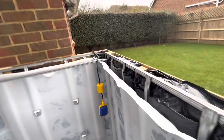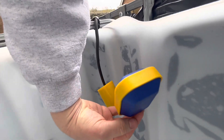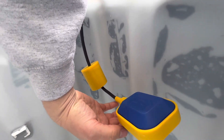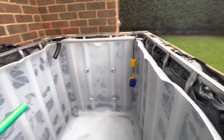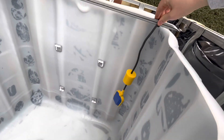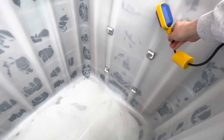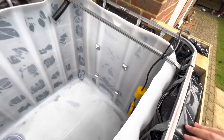That's where I'm putting the float switch. I've put the counterweight there, so I need to double-check once I've got water in the tank — the counterweight should keep it floating up so the switch stays on, and as the water drops the ball changes and it will switch off when it gets to about halfway down the tank. I might need a bit more slack on it. I also need to make sure it doesn't interfere with where my bio filter is going, so I don't want it to sit on top and stop it from switching off. I'll just have a little tweak with it.